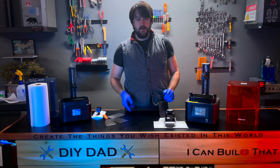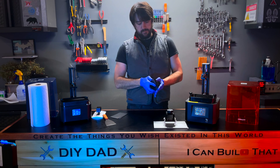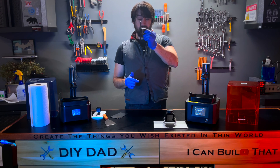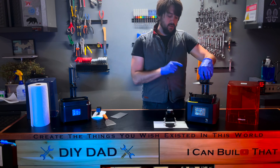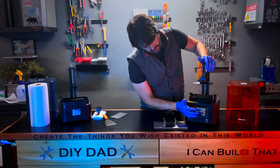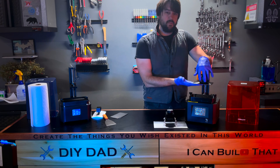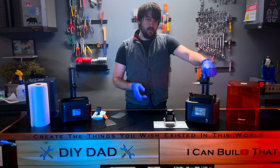The final installation step: once you install a magnetic build plate, you cannot begin printing right away. The reason is that adding a magnet and build plate onto your original build plate makes it thicker, so you need to re-zero your printer. That means loosening the four screws, homing your printer so it lays flat against the screen, and re-tightening them. That resets it to print with the new plate on. I've also got a video on my channel showing how to do just that.